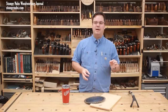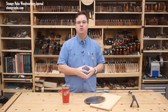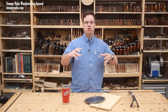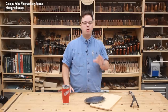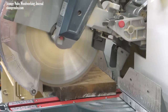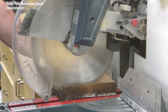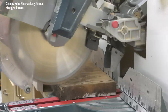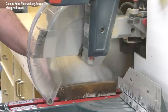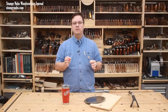But I know most of you are probably not going to do that. If you've got a miter saw on the job site, you're going to use it. So there is another option — it's called kerfing. Kerfing is commonly used when cutting thick materials where the internal stress of the wood might cause it to close its kerf and bind even if the board is straight, but it can also be used for rough boards that have a slight twist or bow. The idea is to score the top surface of the wood with a light cut, followed by another that goes deeper and so on, cutting through the piece in multiple passes. If the kerf tries to close during one of these passes, there won't be enough of the blade buried in the wood to cause a violent reaction, and the next pass reopens that closing kerf and creates relief for the next cuts. This technique can all but eliminate incidents of binding.